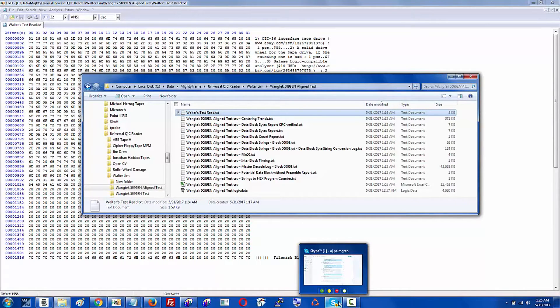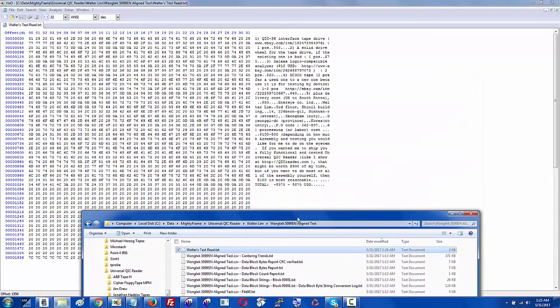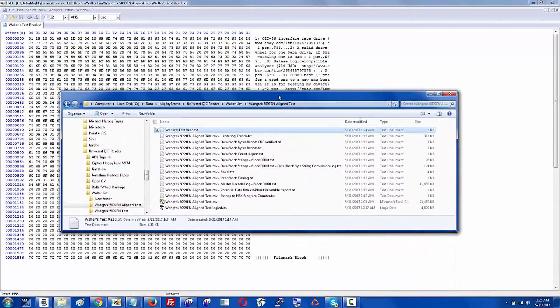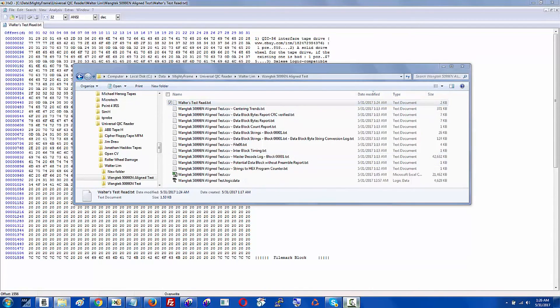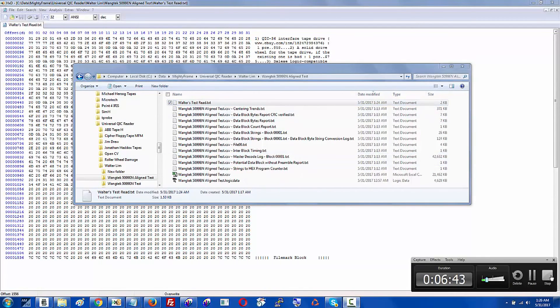I'll do a file save as and save it as walterstestread.txt. I'm going to open it up and see the file. It's the text file that I wrote to that tape in the first place, and it is exactly three blocks long — no more, no less. And then there's a file block mark at the end, which is all normal. The file would technically end before that — when I manually reconstruct files I manually take these things out, but I like to see them because they help denote the end of one file and the beginning of another. The point is, it's working, Walter. I read this on the tape drive that I'm sending to you, and it is most definitely working. I believe we're going to be able to read things that are harder to read, figure out what the format is, what any errors are, and pull the pieces out that we're able to read. I'll be happy to be doing this with you, so I'll be shipping this thing to you soon unless you have questions. Thank you.